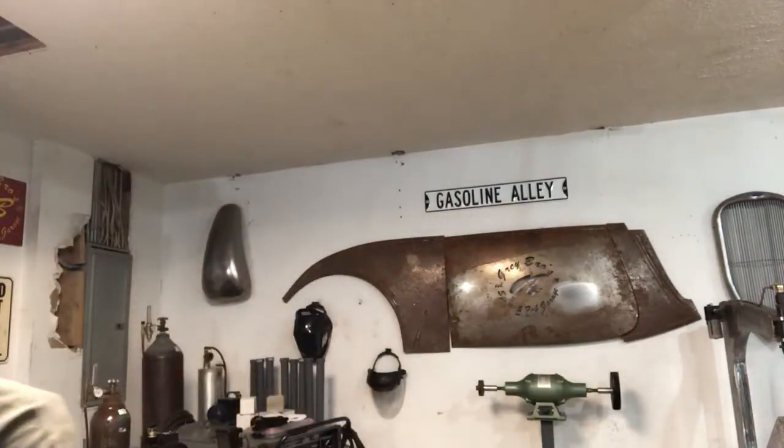I'll show you. This is a brand new 1/2-inch drill bit. If you look, when I turn it, that leading edge to the cutting face is lower. If you want to get critical, you can go buy a new drill bit, figure out the degree, and try to grind it as close as you can.